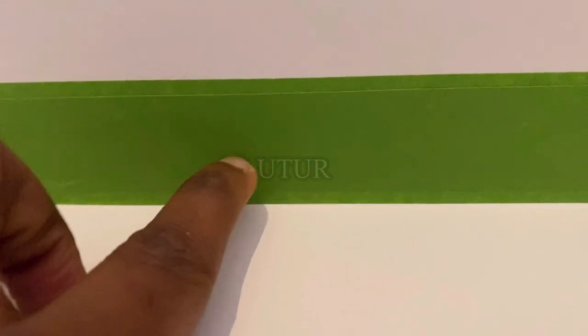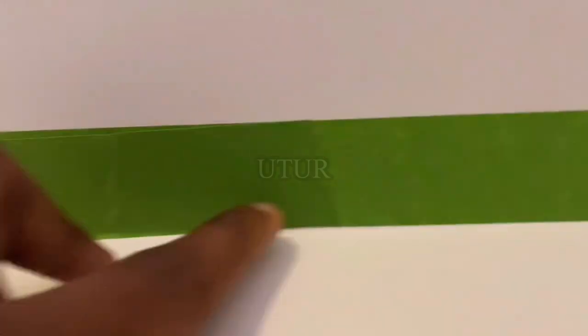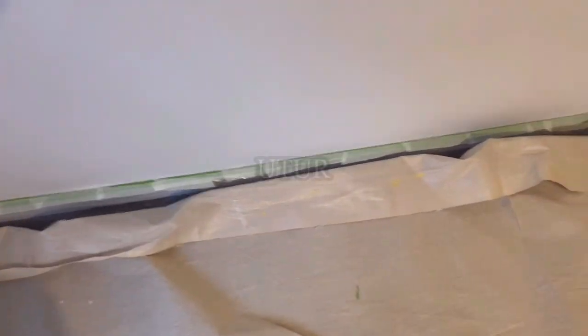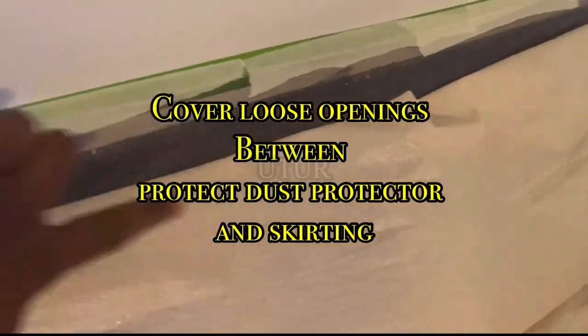I've cut a segment of tape and latched it onto a part where I felt there was a gap — you can see I've doubled up on the tape there just to cover up the defective straight line. It is absolutely important that when you're painting contrasting lines, you've got straight cuts and your lines appear pristine. You can always correct them after you've taken off the tape, but correct as much as you can prior to painting so you have less work to do when you're done.